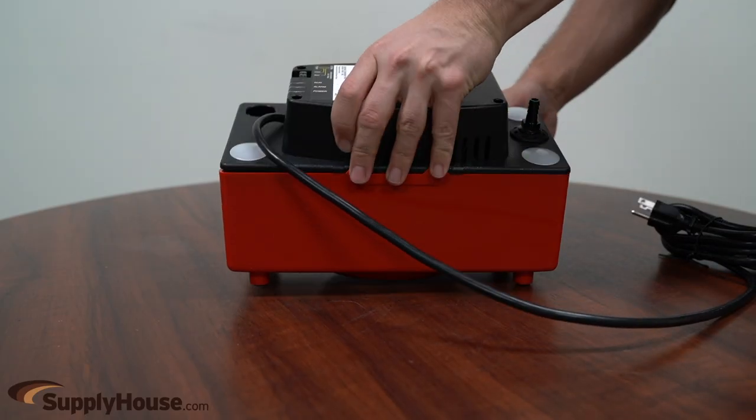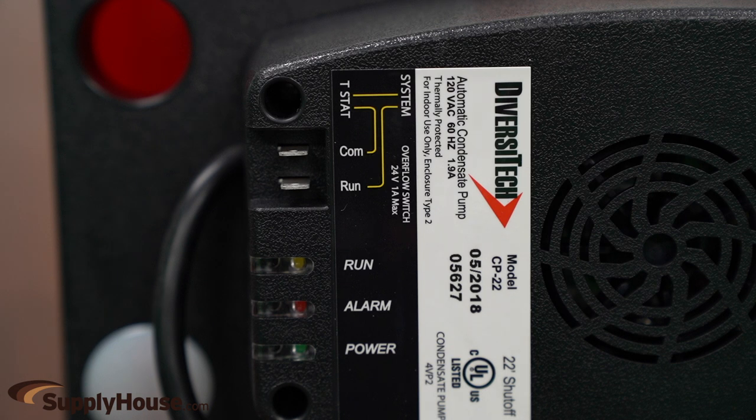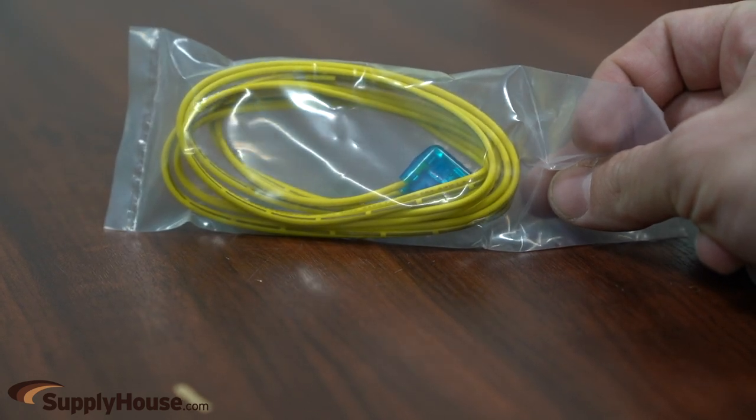Integrating the CP22 into your system is easy. One-quarter-inch quick-connect terminals provide easy connection to the built-in overflow switch. Two terminals are provided, allowing the installer flexibility to connect air handler shutdown. The switch features single-pole double-throw isolated contacts ready for connection to building automation systems.